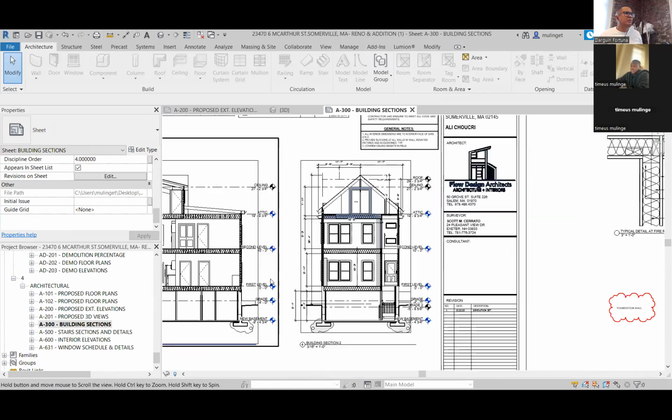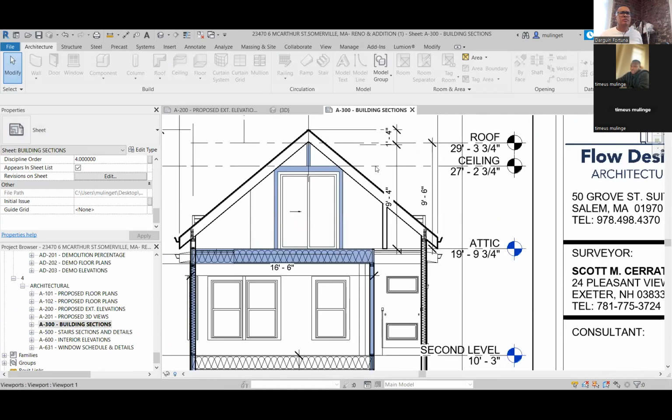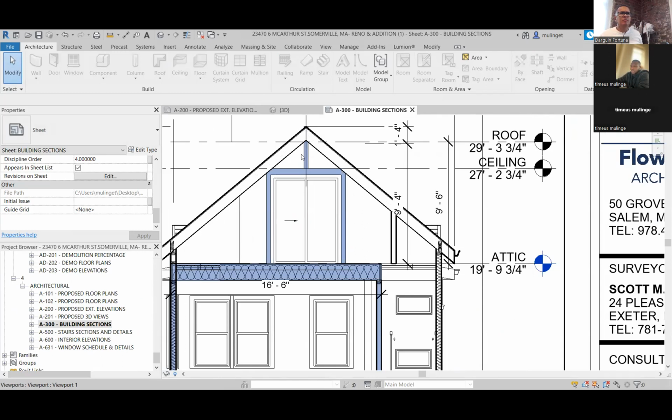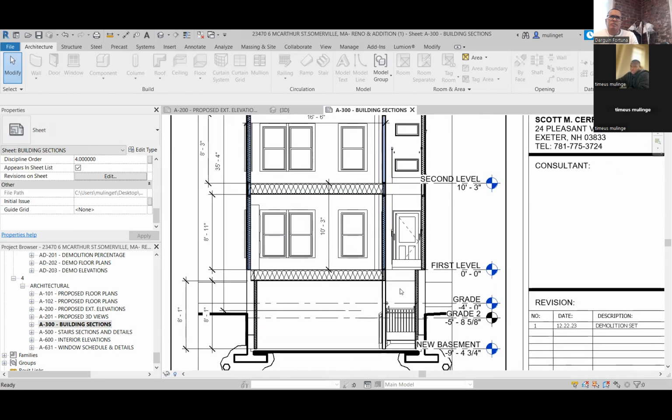So in a way to transfer the loads, I was trying to calculate the load from the ridge beam into a column that is going to be split by a door header, and then down into this beam that is going to be transferred within this wall and this exterior wall. This is the circulation space from unit to unit. And then this goes now to that existing foundation wall. I'm completely confused with what you're trying to do.